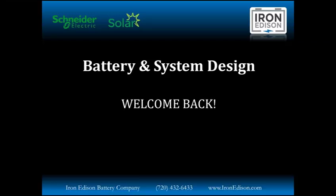We've received a couple of questions asking about the Schneider MPPT charge controller's compatibility with lithium ion or lithium iron phosphate batteries. So I would like to explain a little bit further that the charge profile for a lithium ion or lithium iron battery is very similar to a lead acid or a sealed lead acid charge algorithm. We do a two-stage charge process with an AC source. And when we're selling back to the grid, we will allow that charge controller, the MPPT charge controller, to advance into the third stage so that it's continuing to produce energy and sell back to the grid.